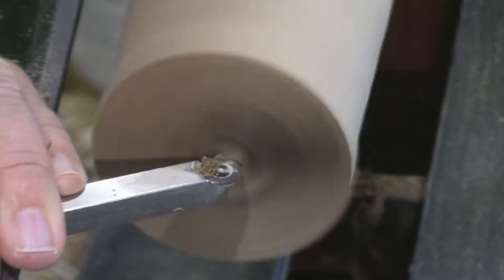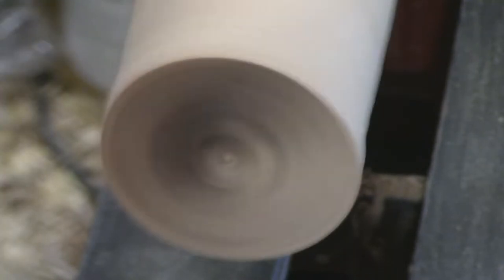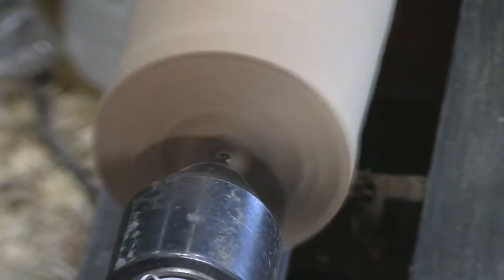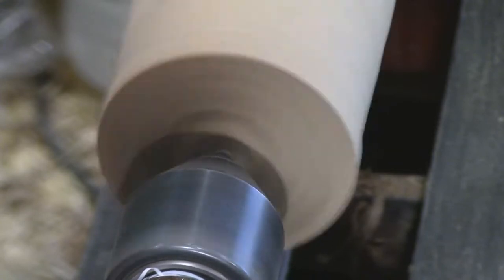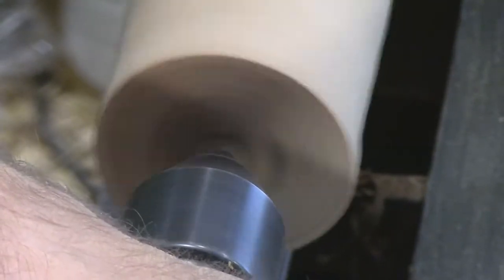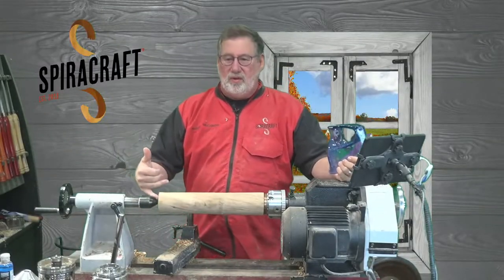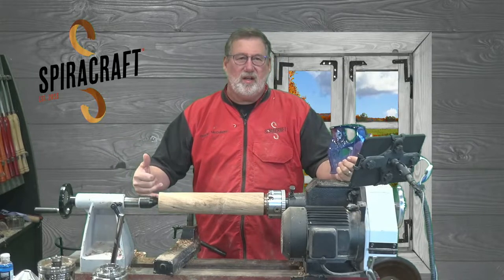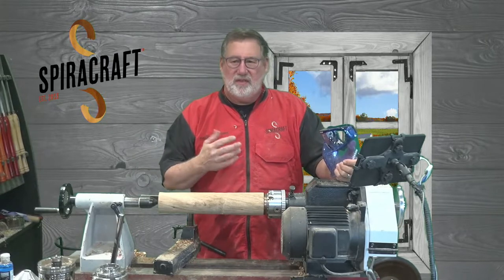The hole for the center was going to push the live center off center. So, excuse the cough, we had to recenter that. If that makes sense, the center was not centered. Now the center is centered. Okay. So hopefully that made sense, Art. That little hole in the center was not in the center, so when I put the tailstock up, the live center would not have gone into that center hole, and it would push it off center and give you trouble. Okay?